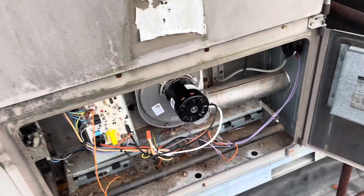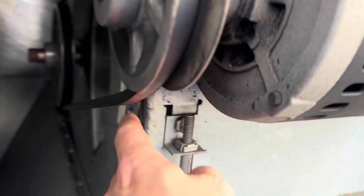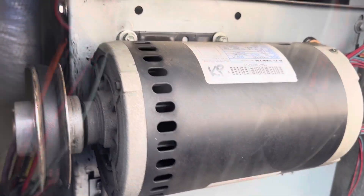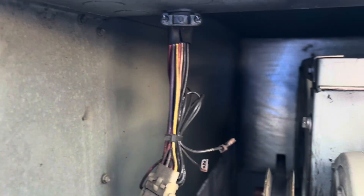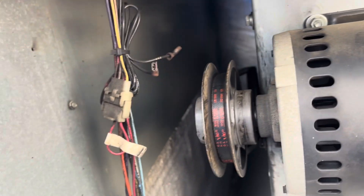It's an A52 — yeah, she's pretty floppy. We need an A52 belt and some zip ties. I don't have an A52 belt, so I'm going to have to tighten this one up for the time being. We've got to loosen the four bolts around here, and then this here will adjust the actual bracket. Our belt's in better shape now — give it a couple more turns of the bolt and we should be good. That's a lot better. Still going to come back with a belt, we just don't have one on us. We'll tighten up these side ones here.